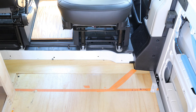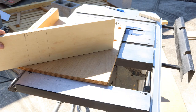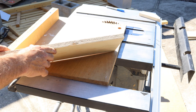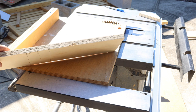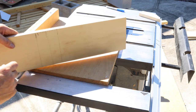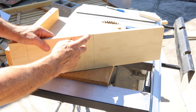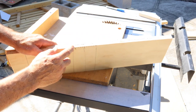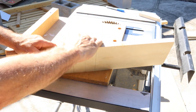In today's video I'm going to show you how — this is a standard sheet of plywood, it is seven plies, and that really makes a difference. The more plies, the better. What we're going to do is cut a lot of saw kerfs and thin this piece of wood up so that we can gently bend it.